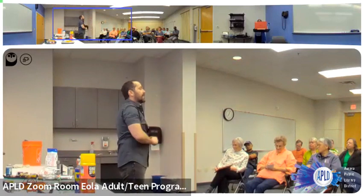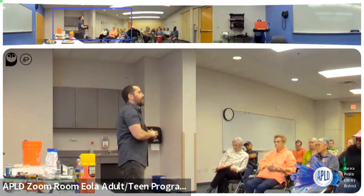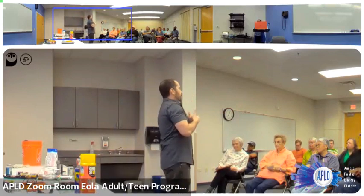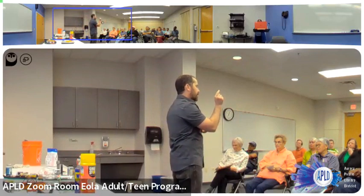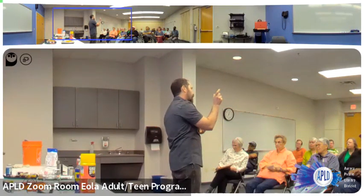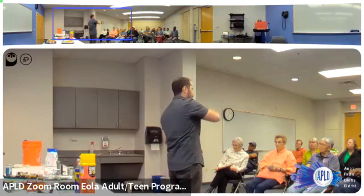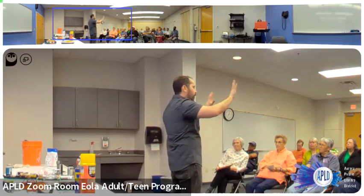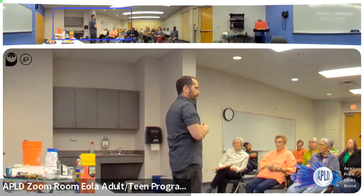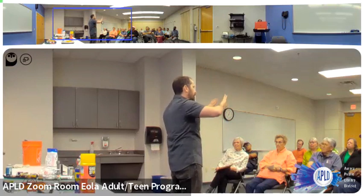The other thing is, if you're doing a patch, particularly in plaster, I have found this very effective. You can get away with getting slightly thinner drywall. Most of the time, drywall is half inch thick. Sometimes it's 5/8. Every once in a while, it's double thick, whatever, doesn't matter. You can get drywall that's a little thinner. So if you got 1/2 inch plaster, get 3/8 drywall. And then instead of trying to just putty those edges, you fill the whole hole. Put that backer in, and then you're filling that whole gap with the plaster or the mud. What it does is it allows just one edge that needs to be feathered out instead of two.